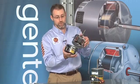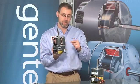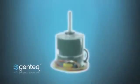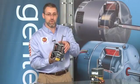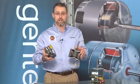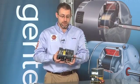However, now the plug from the motor to the control doesn't work so well. So that plug is eliminated, and when you see it in a shaft up application you'll see a little umbilical cord coming out of the side of the motor and then going up underneath the control with a plate on the motor — you can see the picture of that right now. There's also one other application: one manufacturer likes to mount the control remotely, over off to the side out of the weather, with the motor out on the fan blade. So there are three different ways the motor could be mounted, all of them having to do with keeping the motor as reliable as possible.